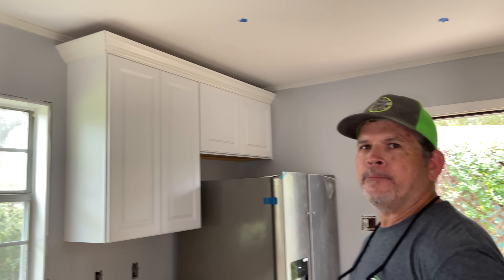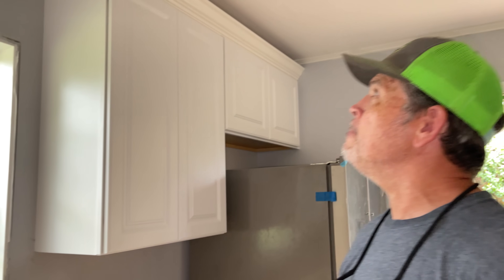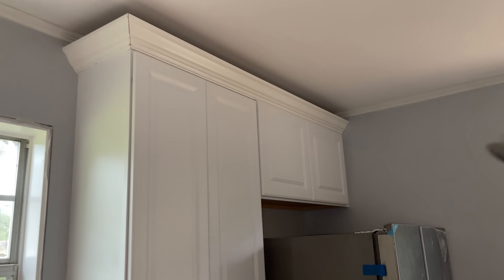I love that method. We got to wrap this up — we're running out of daylight. I think that's my new number one. You prefer this over the notch method? Yeah — the chisels can stay in the case. I don't have to risk damaging the face frame. And do you know what I like best? I like that I can build the whole thing on the ground and put it up with some screws. And if we have to paint it — just remove a few screws, bring it down, paint it, put it back up. It's going to look great. Don't have to paint it in the air.